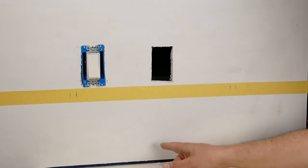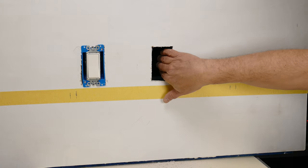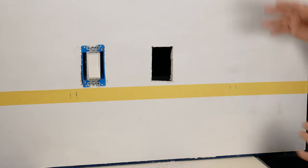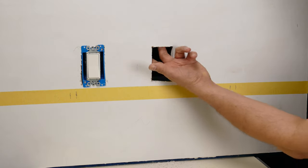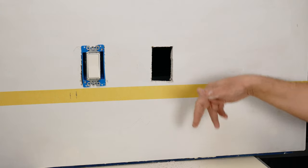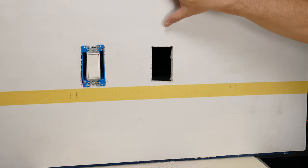Now the hardest part — we want to get the wire behind here. If it's coming from a wall on the other side that's pretty easy; you could just drill or cut a similar hole on the other side and feed the wire through. We're only dealing with about three inches between walls. But let's say we have a more difficult job. Going up would be almost impossible — I can feel it — I'm hitting the fire block, the beam crossways to prevent fire from rolling up inside the wall. I like to come from the basement if you have one, or alternatively from the attic if you're near the ceiling.